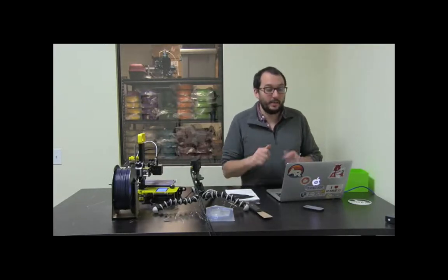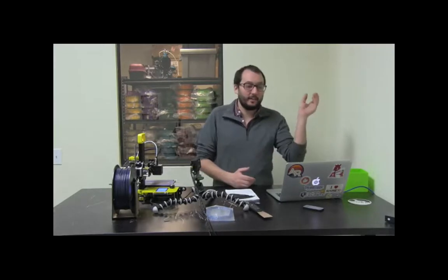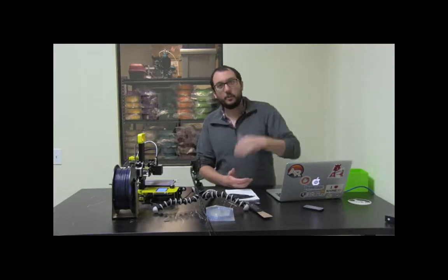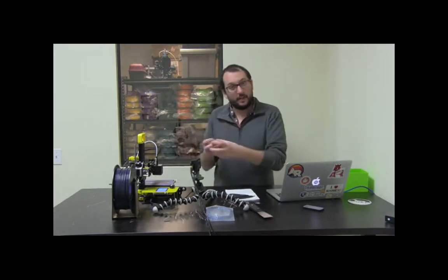Most PLA prints at about 190 or 200, but this PLA actually has a special ingredient in it that makes it more flexible and durable than other PLA, and also just helps it to flow a lot better at 220. So that's why we set that temperature to 220. And that's why we do that soft pull too. That can pull out gunk that might be inside of there. And then when you push out the new filament through, that makes sure that it's fully loaded too. And when it's liquefied, it'll print a lot better. So yeah, technically he's totally right.